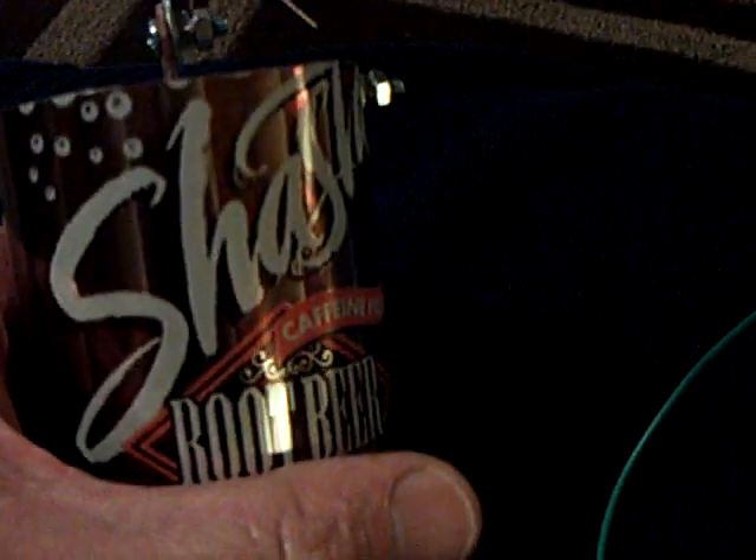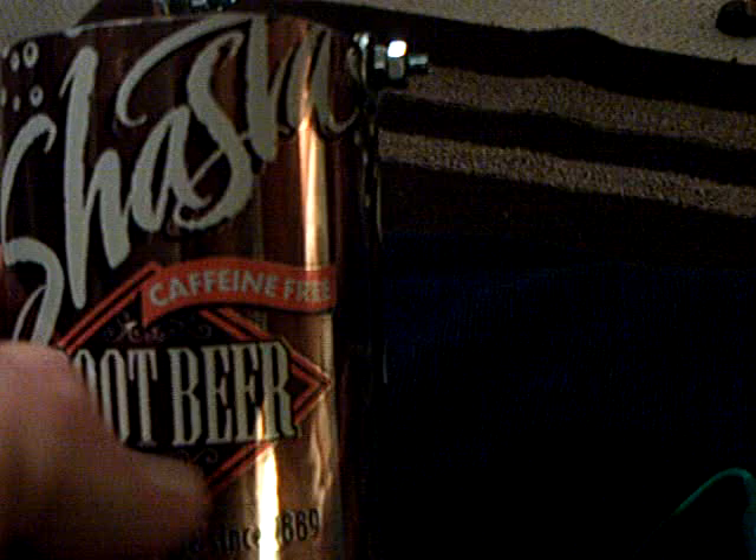The other one I made — I made this yesterday, and it hasn't seasoned yet. It's a root beer can — it's the best I could do. I used a mixture of white marble and engine block sealer along with Portland cement. It didn't come out as good, and I haven't figured out exactly why, but I got about 1.1 volts out of that cell and pretty good amperage, because I used the coiled-up copper tubing on it, so that helped for the amperage. But the voltage wasn't very good, and it wouldn't charge up.